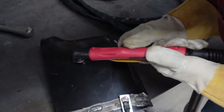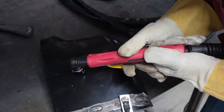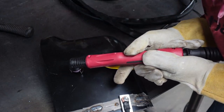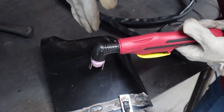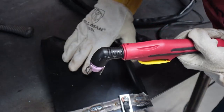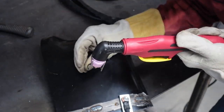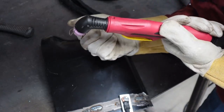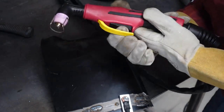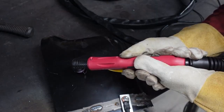If you want to make a hole in your part, you don't have an edge to start from — that's called a plunge cut. Hold the torch at a 90-degree angle from the workpiece, but never start a plunge cut straight down on thick material. The sparks have nowhere to go but back up toward your tip, which will ruin it almost instantly. Instead, start at an angle to get it going, then bring it to 90 degrees to do your cut and make your circle.